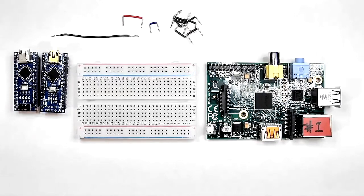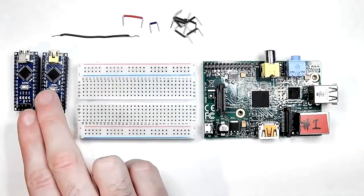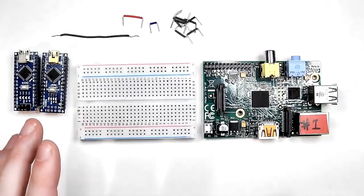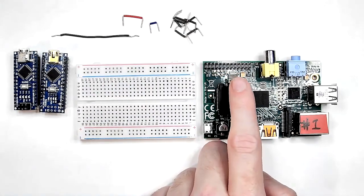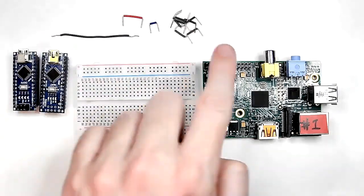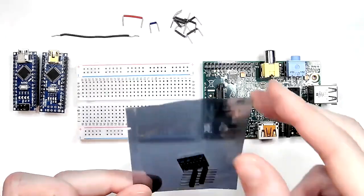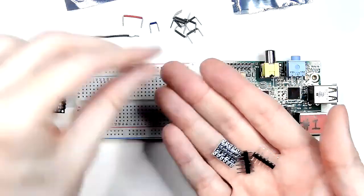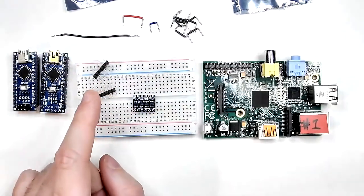There is one more key component we're going to need. The Raspberry Pi is going to form a big chunk of the project — it's still an 8-bit system driven from the Arduino ATmega 328P — but we now have a voltage mismatch issue. The Arduino runs at 5 volts, but the Pi's GPIO is only compatible with 3.3 volts. If we drive a 5V signal into the Pi's GPIO, we can damage and fry the Pi, so we need a level shifter. You can pick these up very cheap.